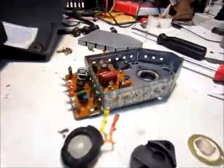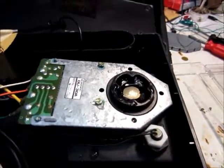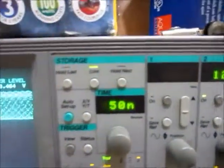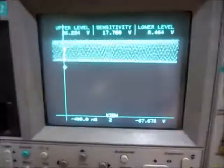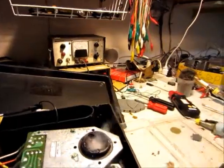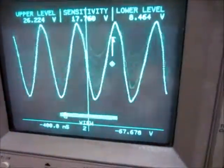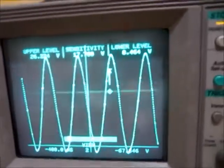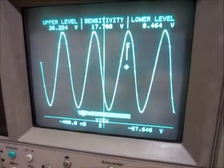So what I want to do is hook this up to the oscilloscope and try to figure out what frequency it's operating at, so that I can try to make my own with one of these. I don't know if that's going to work or if it would ruin it. I've got my oscilloscope hooked up. I'll turn it on and show you what the waveform looks like. That's the waveform at the fastest time division. You have to zoom in a bunch to see it. I have no idea what kind of waveform that is — I mean, it's a sine wave, but it just kind of keeps pulsing on and off.